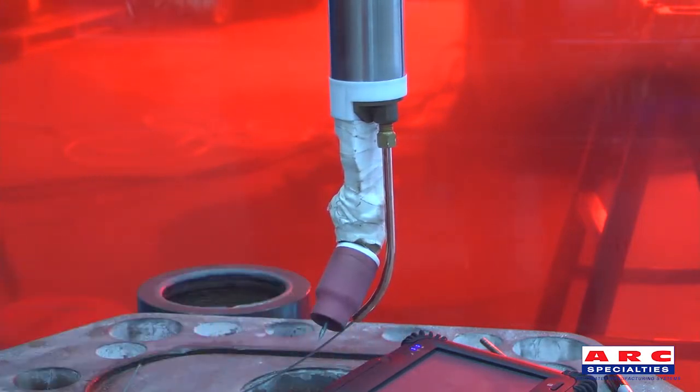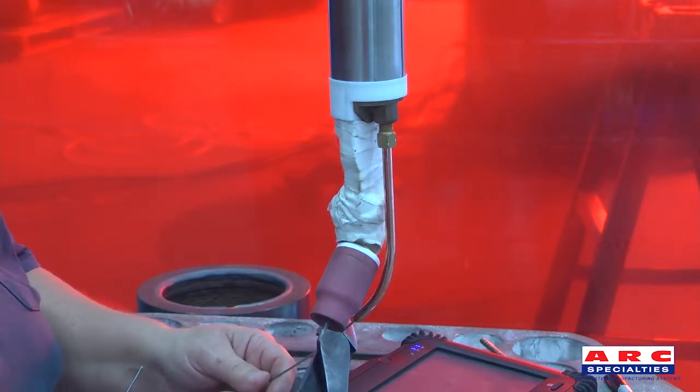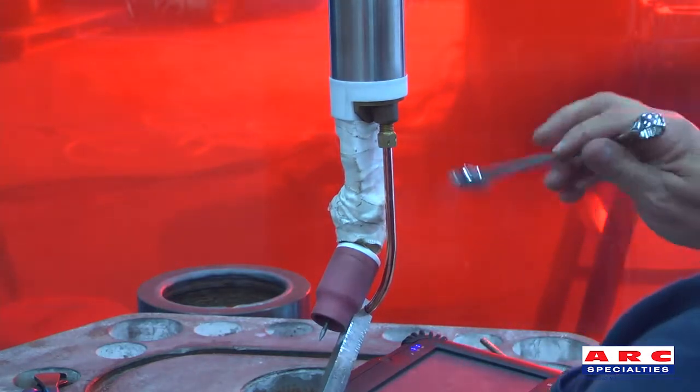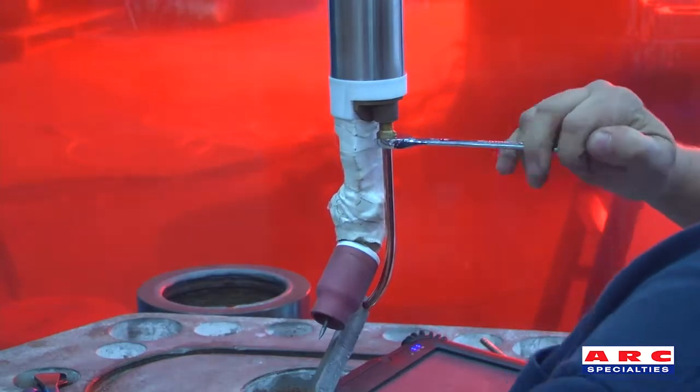By putting that wire in there, it saves the hole and keeps it open the right amount during bending. While tightening, use the bender to hold the wire guide so that it can be fairly tight. That way, while it's being bent, it won't move very much.